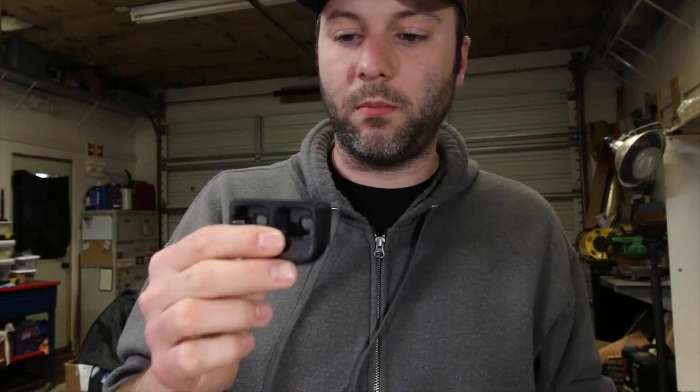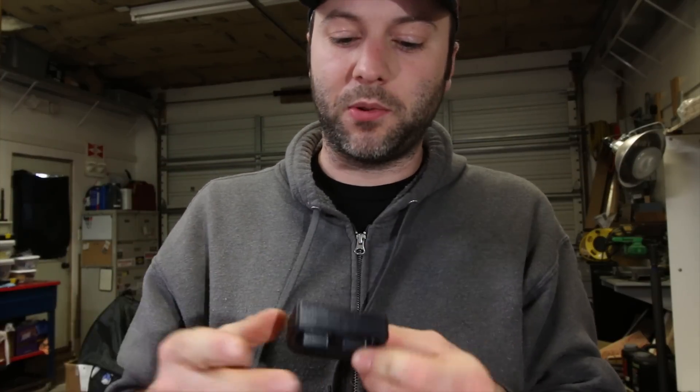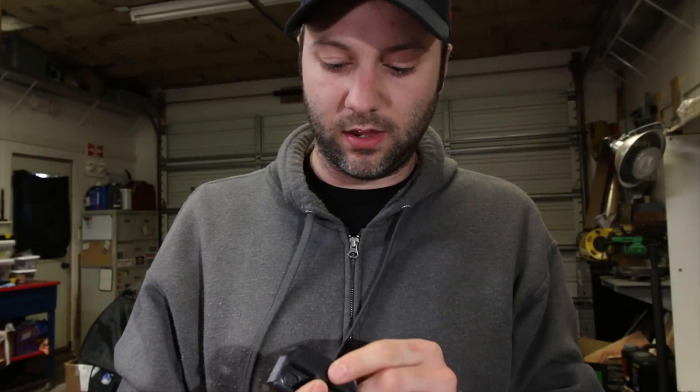I made a second attempt while moving the Prusa into my enclosure that I normally use for my MakerGear M2, and it printed much better. I also added a giant brim around the outside — 10mm in fact — and that allowed me to produce this part. This part is much flatter with the brim. I'm pretty terrible at cutting the brim off cleanly and I did nick it a few times, but for my application it's not going to be a big deal since you won't see that part of the print anyway.